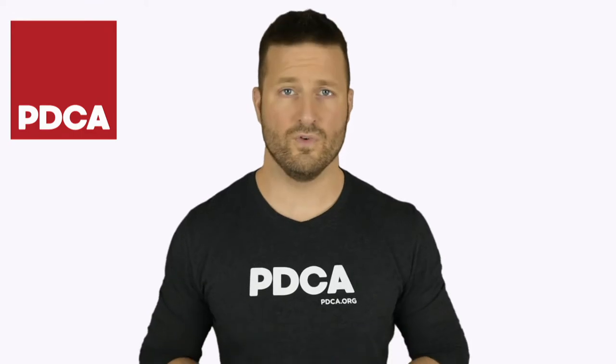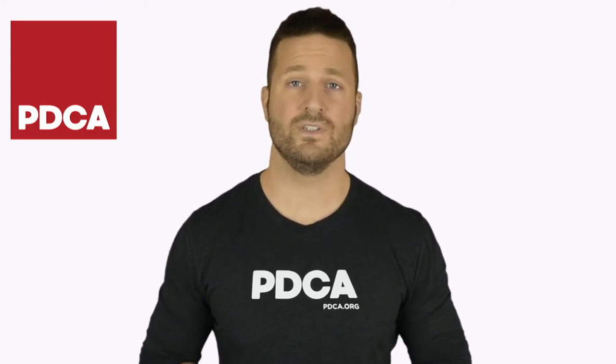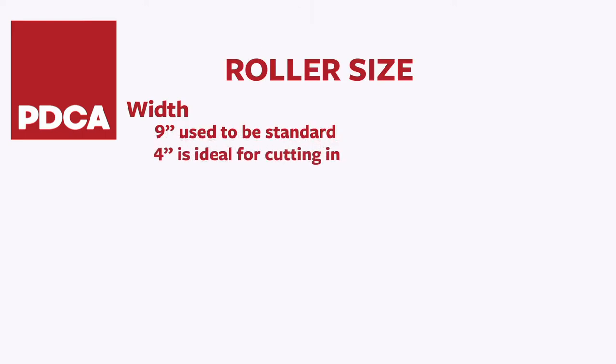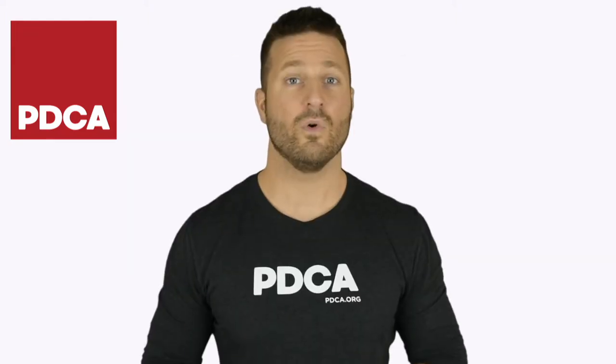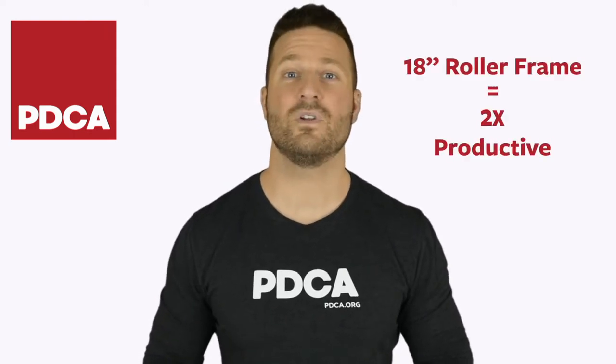Then there's the width of the roller. The standard for years was 9 inches, but there are many more options now. A 4-inch roller is ideal for cutting in. A 14-inch roller is the new standard for walls for many companies. It's 50% faster in most cases. Painting floors or larger walls? An 18-inch roller will make you twice as productive.